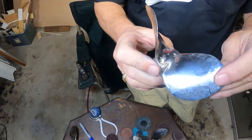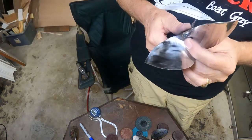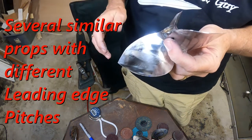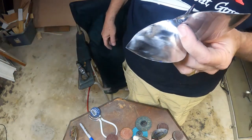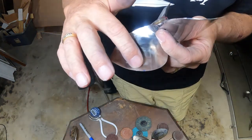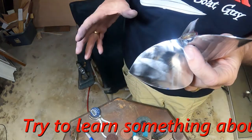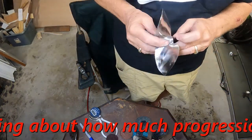When I go back to the water, I'm going to have several blades with different leading edges. I'm staying with all the same tip — same tip angle, about 8.2 — but I'm going to change up some leading edge and some trailing edge on very similar props and go out there and see what I can change without losing acceleration. That's kind of the plan.